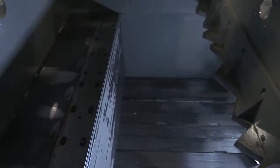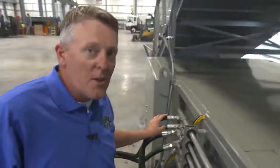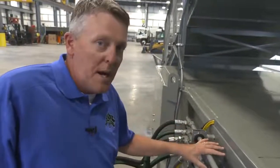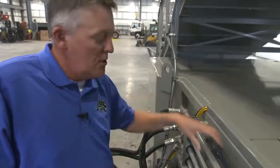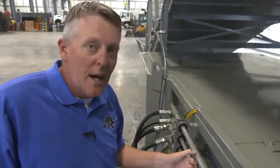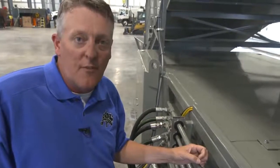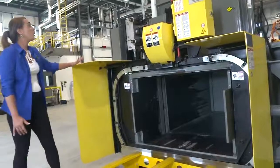This machine is built like a tank. One of the other important parts is that we use hard piping on our hydraulics. When we come off the main power unit, we're using hard piping coming out — an important part is that we're not having the rubbing on the material, plus it's a safer design.